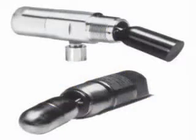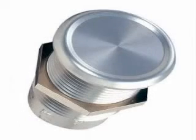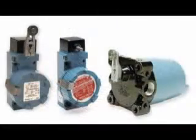When such environmental concerns exist, other types of contacts can be considered for small switches. These other types of contacts are sealed from contact with the outside air, and therefore do not suffer the same exposure problems that standard contacts do. Some switches are designed to be used in environments where there might be flammable gases. These are called explosion-proof switches. They use sealed contacts.